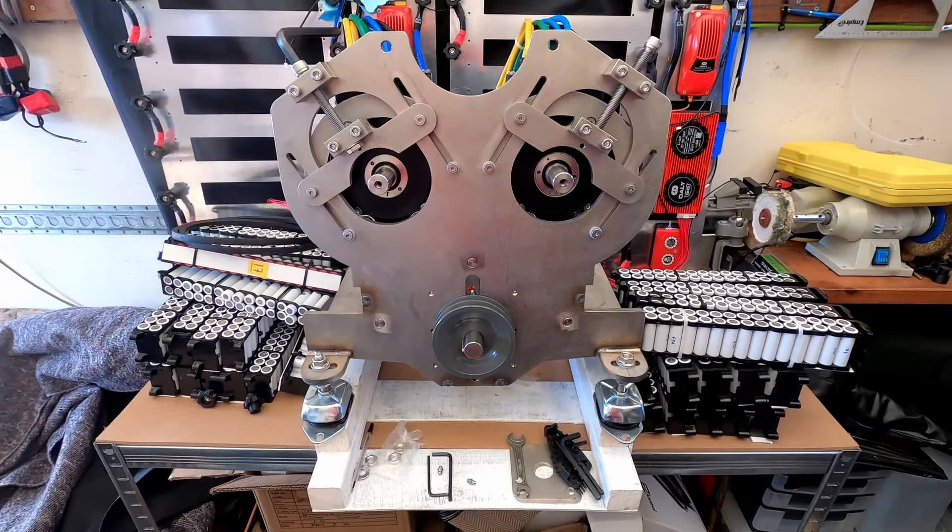This is the last batch of four thumb screws and four pairs of isolation connectors. This time I'm going to drill an M8 hole straight through and use copper rods to connect the rear and front of the plate together to complete the 14S configuration. There are also new parts — these half-circles: put two together and you get a little rod, which adds additional support to the battery pack. You can see the little holes here; I can epoxy those in and that should make the whole pack more rigid with another four or five on each pack.